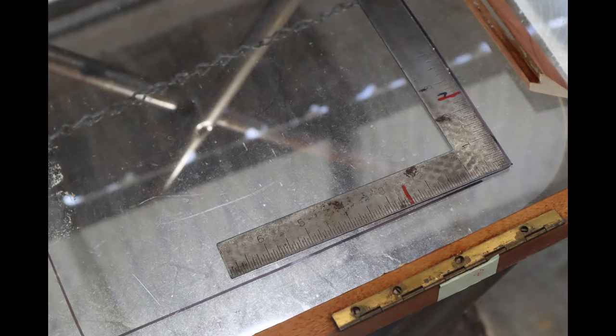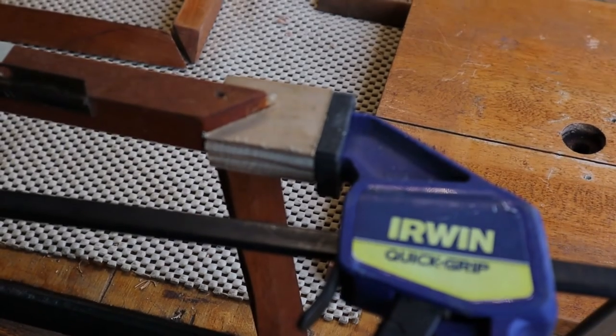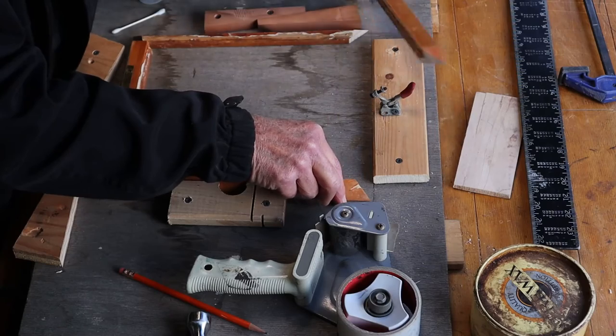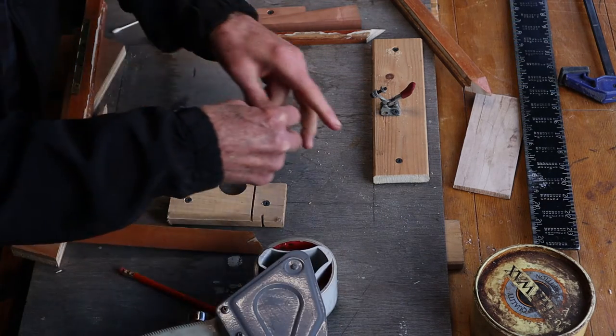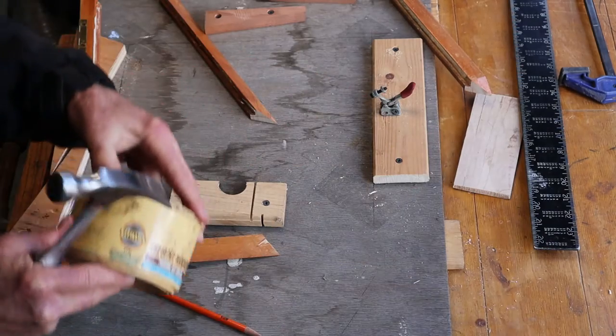That one's quite open, so it takes a little bit of adjustment. There's just a little bit of a belly in this one, but it may pair up pretty well once I put it into the clamping fixture, which I had to make. This shows you the glass and how it's just out of square. This is one of the frames that needed less attention. I just made up this little fixture and put it together. This fixture uses what they call folding wedges — very good for irregular shapes or picture frames.